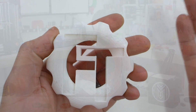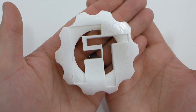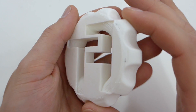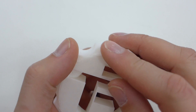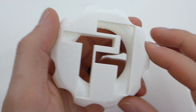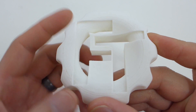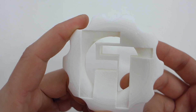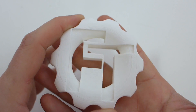First up we have Polymax PLA by Polymaker - obviously white. It turned out great, this is printed on the CR10, there were no significant issues anywhere that I could see. The walls all came out really nice, it did fairly well over the support, better than most cheap PLAs I would say. There was a little bit of something on my nozzle that clearly came off onto the print - that was not the filament at all. The top layers show no real under-extrusion or over-extrusion. I printed this at 205°C at 70mm/s, no problem at all, it came right off the build plate.